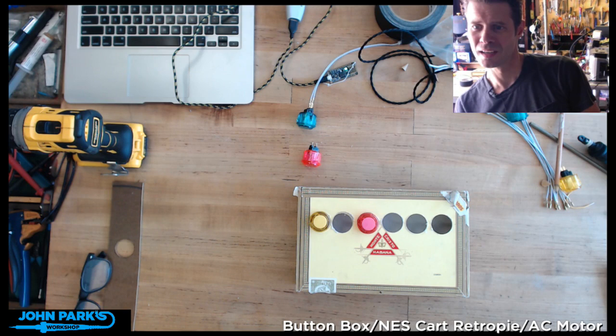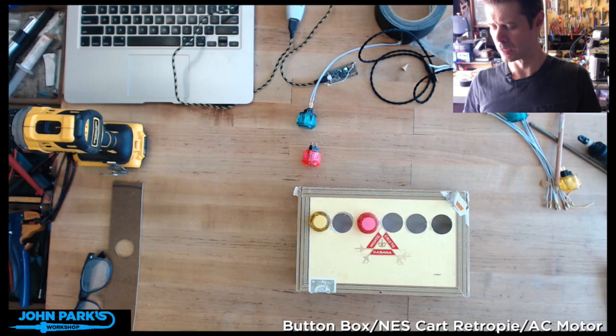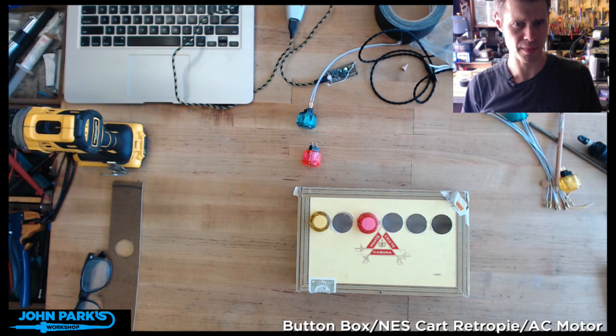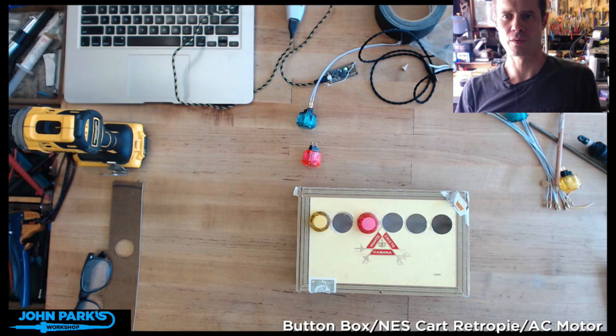Yes, stuff. The drill press would definitely have been better, especially if you're doing holes with any kind of depth, because you never come in at angles straight when you're doing it by eye with a hand drill. So if it's something where you need a straight hole and not the sort of hole coming in at an angle, drill press is much better. I think this was a little easier for me to film, though, but one day I will have the camera thing under control, and I'll have one over there at the drill press.